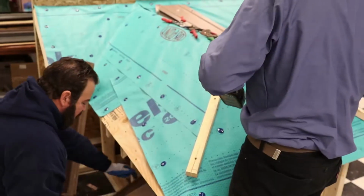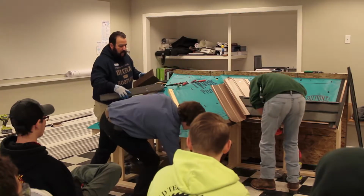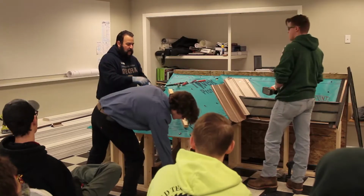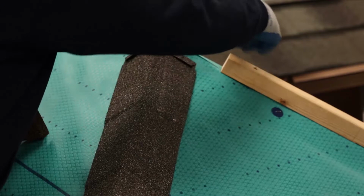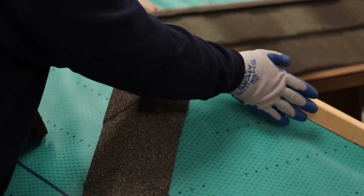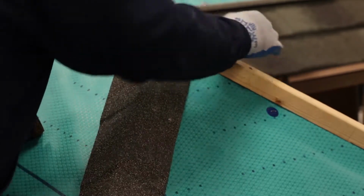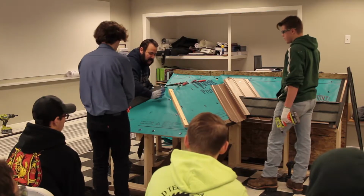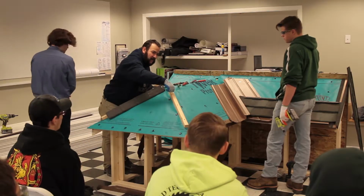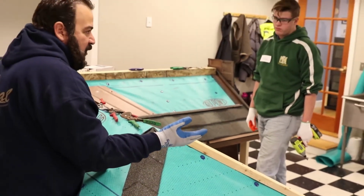And like I mentioned earlier, with the shingle product, because all this is lower profile, when we put these caps down on a hip, we've actually got enough room to not run this and just basically run one side of panel, cut it, run the other side, usually kind of against your prevailing winds. You'd fold that over this way, so if most of your winds come in this direction, we'll cut this side flush, run this side a couple inches long, beat it over, and then we'll just drop the cap down right over the shingles themselves, kind of like asphalt shingles.